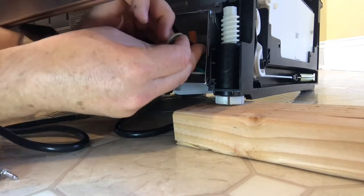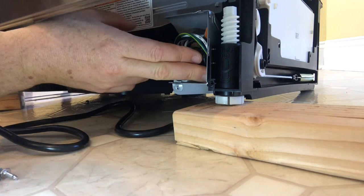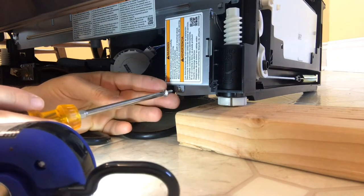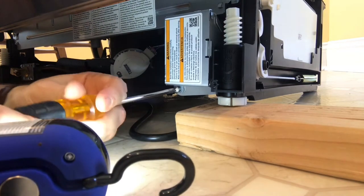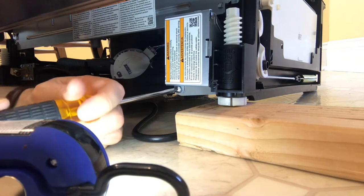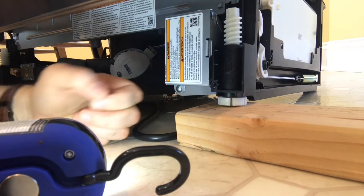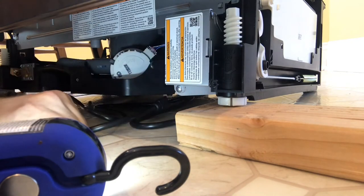You have to kind of squeeze the wires up so they don't get pinched or kinked. There's my front plate - it clips in there and then we screw the whole thing back in. Make sure that plate is tight. The cord comes at the back and it's secure. Our screw is now secure. This dishwasher actually has a little channel straight down to the back, so the cord goes straight down to the back and then out the back. And we're done with the cord.